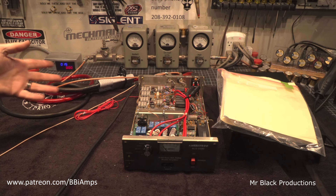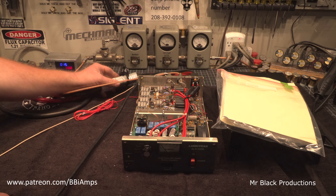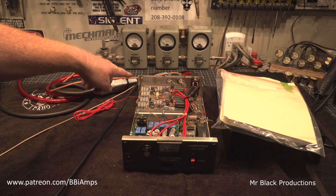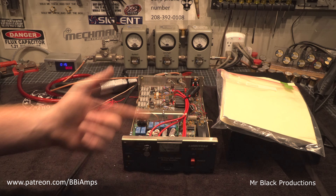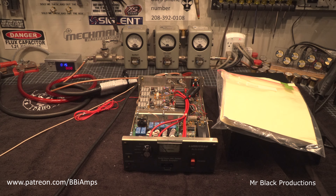It's got upgraded power wire, upgraded Anderson clip because this is what you actually should use. I think the power wire that comes from MFJ is too small. I think that it gives people the false illusion that this thing doesn't require a great deal of power. It does — it's a 110 amp draw on average.